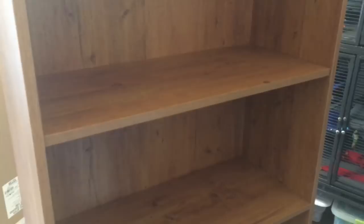Make sure you do this for every single shelf. I even include the middle shelf — even though it's screwed into the side — because I don't want the back to be pushed out slightly. I also put nails in the bottom shelf for the same reason. Anywhere you can push the backing out, nail it down.